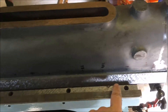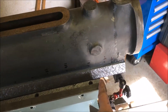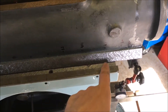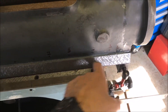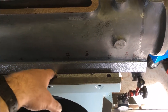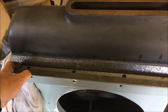So the next question is, do I take it out of the surface that it's running on on the main body? I've got to assume that that would be set 90 degrees perpendicular to the vertical faces. That's a lot of material to shift underneath the ram. If you work on the basis of from that point, nine inches back, it's got to be 4 thou down, and then translate that to the next 22 inches back, I'm going to be removing way, way too much material.